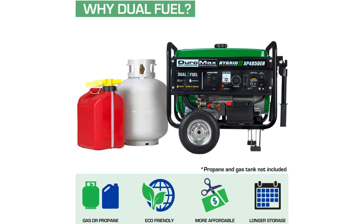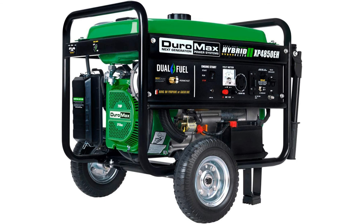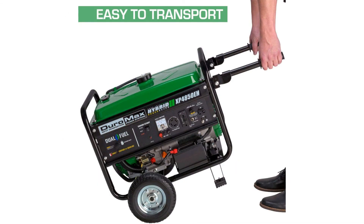Keys for propane use: the choke is always on or closed. Press the propane valve primer. This is why some confused people complain it won't start on propane. There is no hybrid switch, so shut the gasoline valve off — you're on propane. The battery wire is disconnected on delivery and is hanging from underneath the unit, so connect that. It's not the spare wires that come separate — you don't need those.